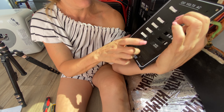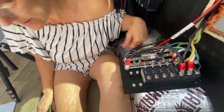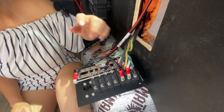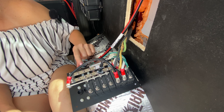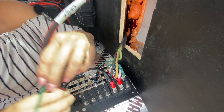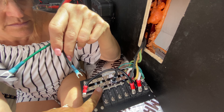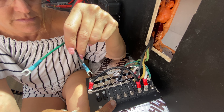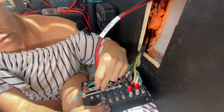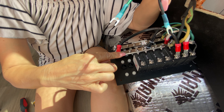So now we have the hot water heater, which we're going to put on this circuit right here — this is our last one. It's a 20 amp breaker. It's going to work the same way: we're going to put the black here as our live, the white here as our neutral, and the green here as our ground. Let me ask — the black is already all black, right? Yes, because it's sending the current through, and when we turn off the main it'll turn off.